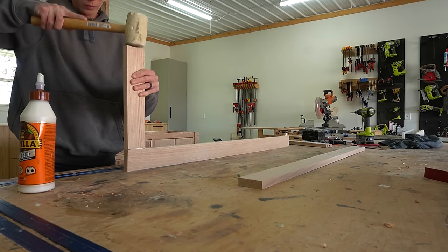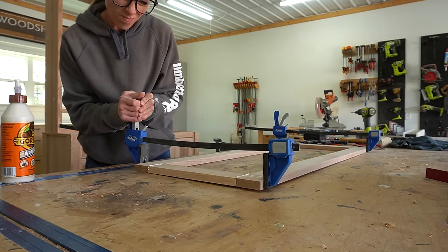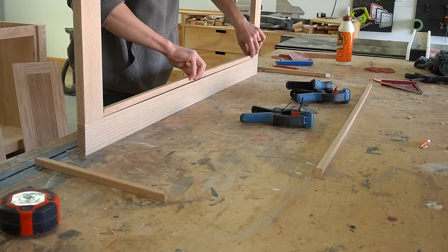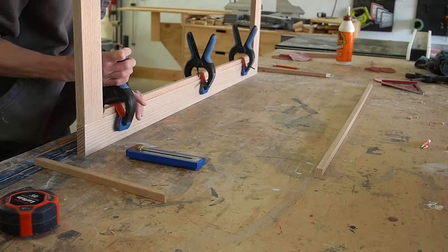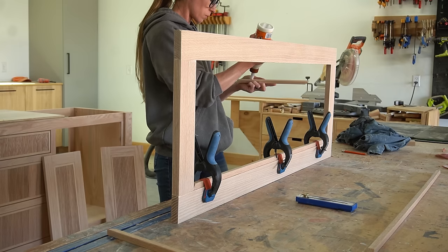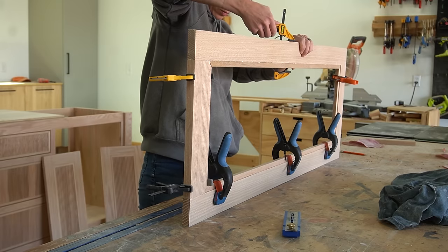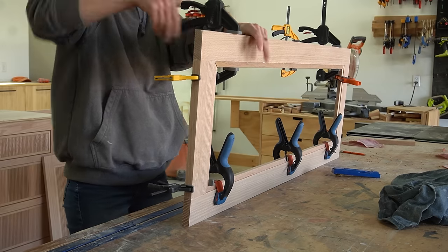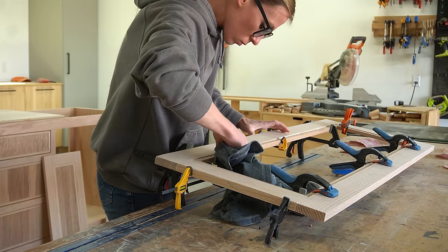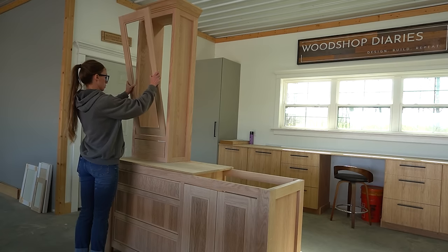Now I needed to add the door and drawer. I wanted this door to be clear — actually acrylic, not actual glass. So I assembled a 1x3 frame for the door using wood glue and dowels. I had leftover square pieces from ripping the fluted trim, and I thought adding them inside the door would tie the drawer fronts and doors together design-wise. These pieces are about 5/8 inches thick and the door frame was 3/4 inch thick, so I glued them inside the door frame about 1/8 inch inset from the back edge. The acrylic sheet I'm using is just under 1/8 inch thick so it fits into this recess perfectly.